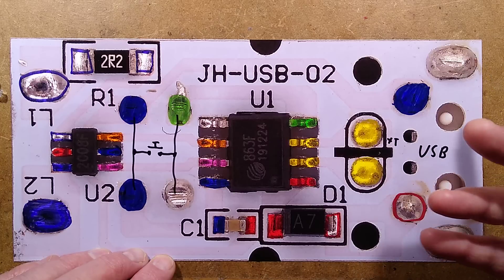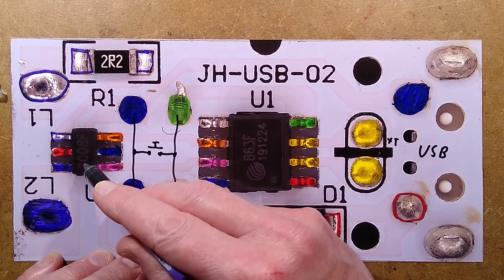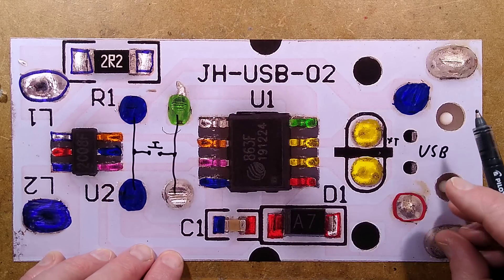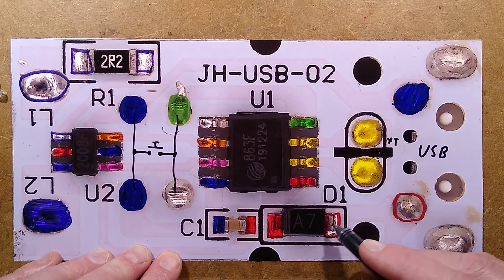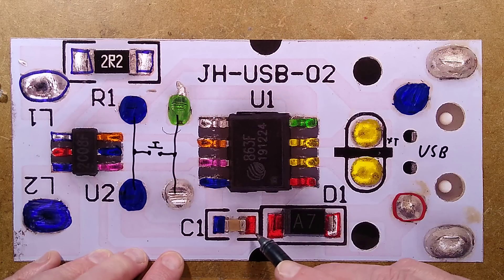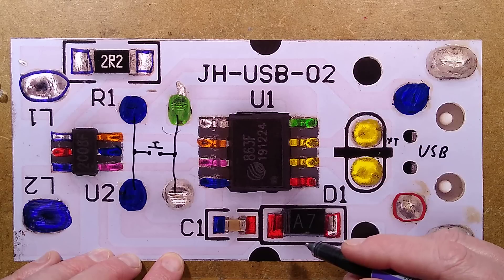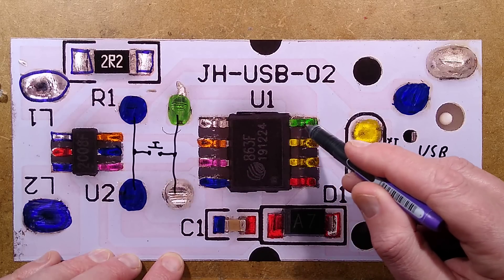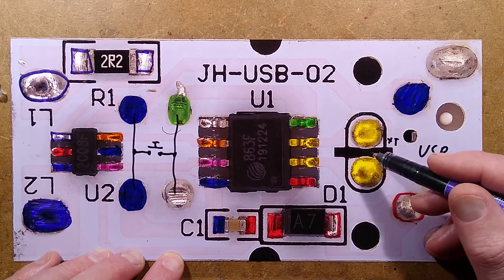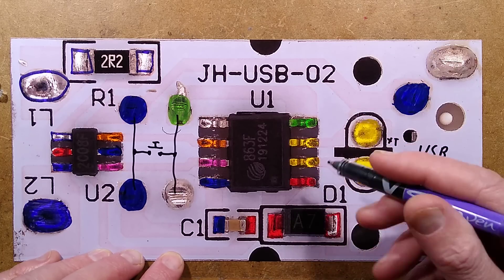It's got the same pinout you'd expect of a microcontroller. The negative also goes around and provides a negative to the H-bridge driver which swaps polarity to the output — more on that later. It's called a 2C08F, which drew a blank — not a surprise. The positive goes through a polarity protection diode, which also drops the voltage slightly — beneficial for dissipation from that resistor. There's a decoupling capacitor of roughly 100nF measured in-circuit across the two pins of the microcontroller.